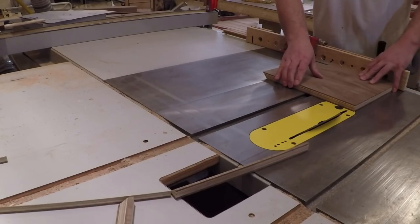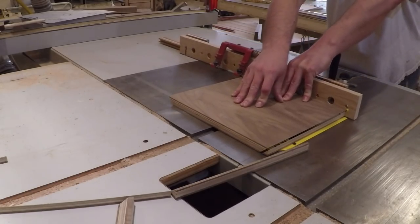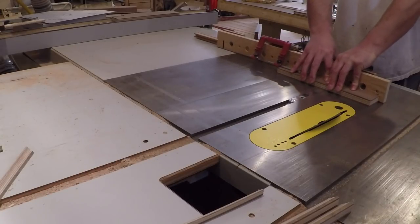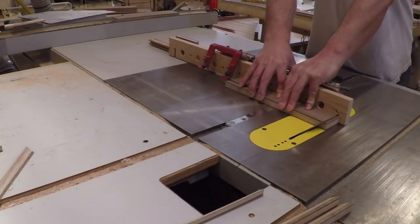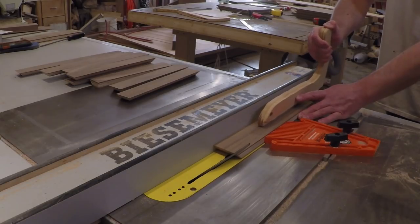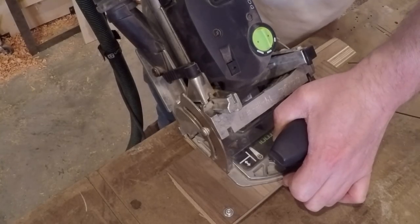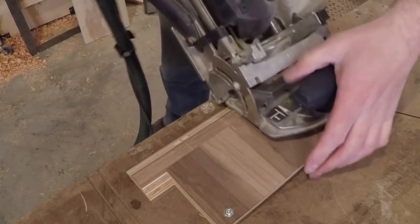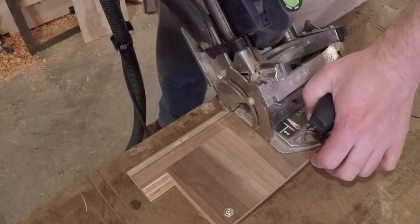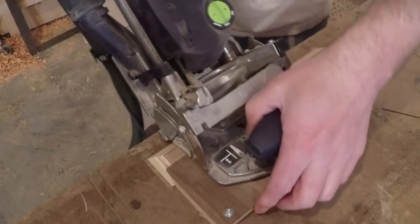Once out of the bag I started cutting them to size. I set a stop on the miter gauge to be sure all the pieces would come out exactly the same length — you can cut a perfect miter but it's not going to close tight on all edges if they're not the same length. While I had the stop set up on the miter gauge I cut the front and side pieces as well, then ripped all the parts to the appropriate width. Since the shelves have five pieces to hold together and I have to get eight miters lined up at the same time, I added a few dominoes to act as a third hand. To cut the dominoes on these narrow fronts I screwed a stop block to my table with the opposing 45 degree angle to trap the narrow pieces, making it safer to cut the mortises.